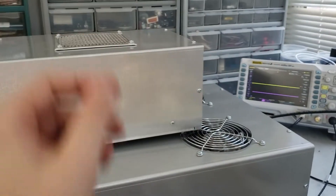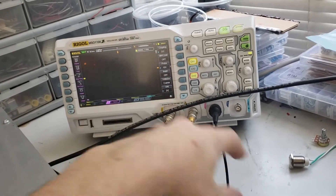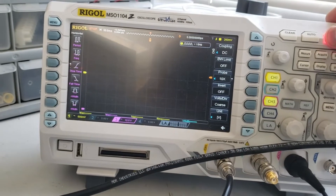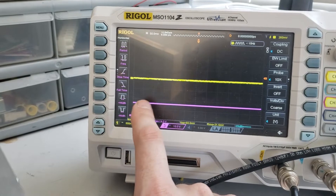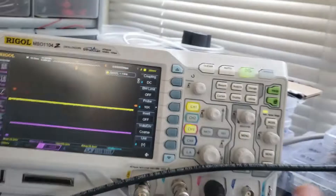I'm going to show you that on the oscilloscope because it's kind of cool. I'm going to put this in single trigger mode. I've got an RF sampler from the output of the amp going into channel 1, which is the yellow, and I've got channel 3 which is the purple channel — that probe is just monitoring the output voltage on this power supply, not the input but the output. So right now our output voltage is at 14.4 — that's the power going in and it basically goes in one side and out the other. The yellow RF sampler shows nothing coming out, so it's just a straight line. I'm going to take a sample of what this looks like when we first key it up.